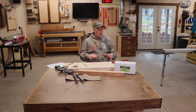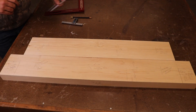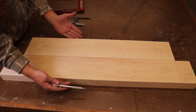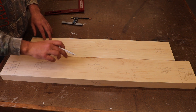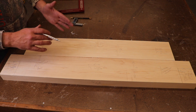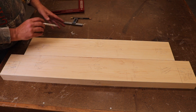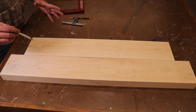I have this marked 'top' down here, and I have the same mark on the back side of this one, so these two boards come together — and that's because they are different widths. This is made so that this one is just a little bit smaller so it registers against the front of your bench, kind of like a hook effect. The back board is only five and a half inches wide per the plan, and the front board is five and five-eighths — also per the plan. The front vise is 32 inches long.